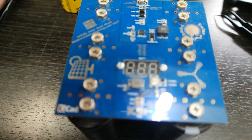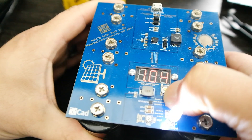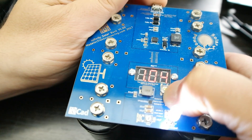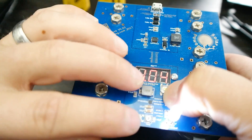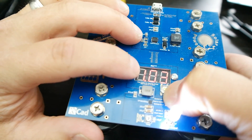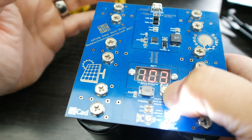Here's a currently working unit with the LED on. If you press the momentary button, as long as the boost converter is set to a minimum of 3.3 volts, the display will work correctly. Also, if you're plugged into USB or have a good solar source you'll usually have at least 3.3 volts for a correct reading. If your boost converter is turned down to 2.5 or 3.1 volts it will power up but the display won't read correctly — these displays require a minimum of 3.3 volts.